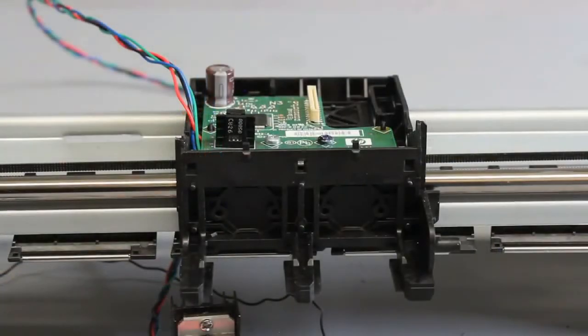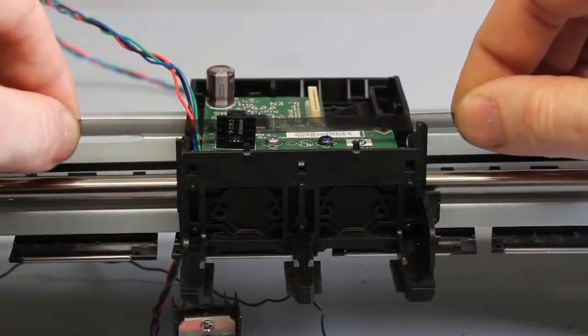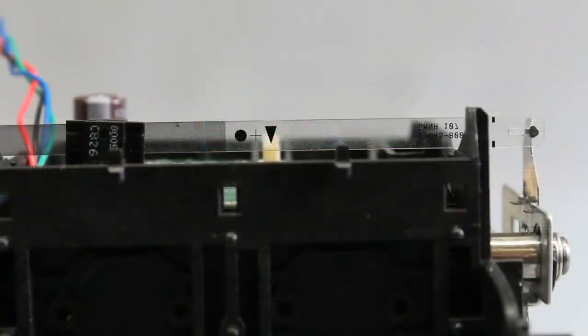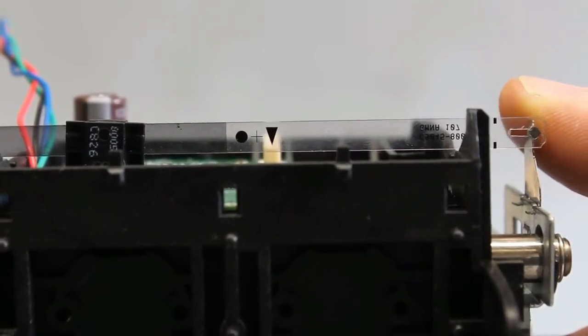The microcontroller detects movement in relation to the line pattern on the sensor stripe. When removing the tab from the mechanics, the carriage is controlled in such a way that the printhead follows the movement of the plastic stripe. Ensure that the sensor stripe is mounted tightly, which is done by a spring steel plate at this mechanics.